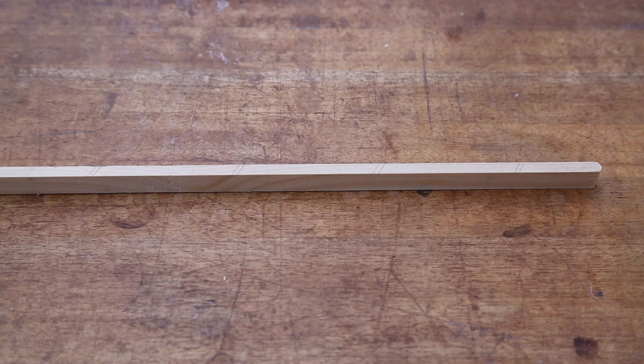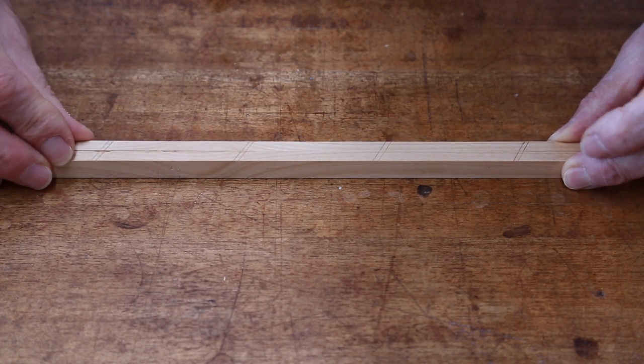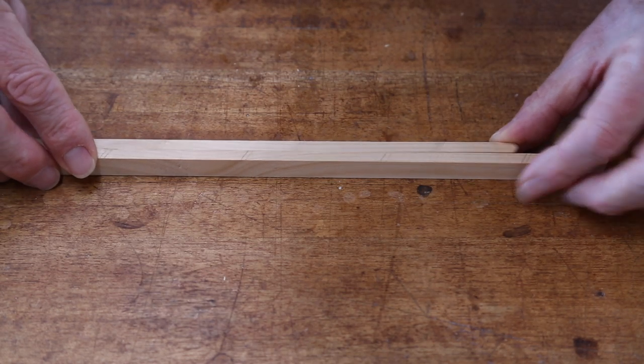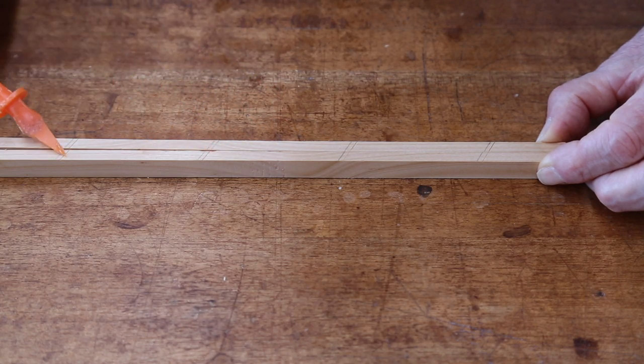The first step is to mark up the story stick. Mark 7 joints at equal intervals of exactly 65mm, and make sure you trim the end on the 60 degree jig. Allow at least 40mm from this end to the first joint mark. An important step here is to check the accuracy of your marking — transfer the story stick marks to a scrap piece, then move the scrap piece or the story stick one joint. If the joint marks still line up exactly, your marking has been accurate.